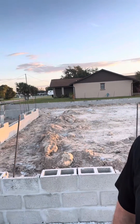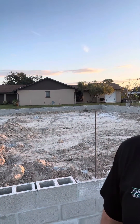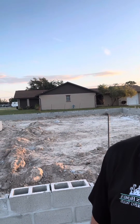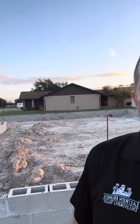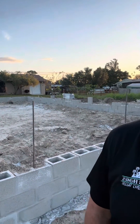Hi, this is Fred Price with Lauren Homes. What we do when we build a foundation or a slab to get you up to your finished floor elevation is build what they call a stem wall. Behind me here is the beginning steps — after we build the pad for your home to be built on, we build this wall around it that ties into the footers below, which are already dug.